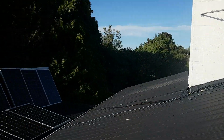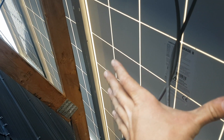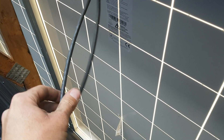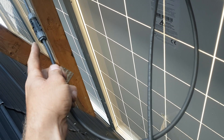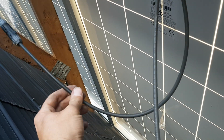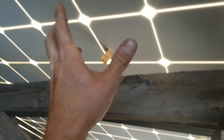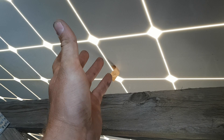I moved them from over there. These three panels — one, two, three — these are the old ones, hooked up a specific way. Apparently solar panels do not have a standard on which way the MC4 connectors hook up. These ones were hooked up the same way as all my other solar panels, but these three new panels have the same MC4 connectors hooked up backwards.